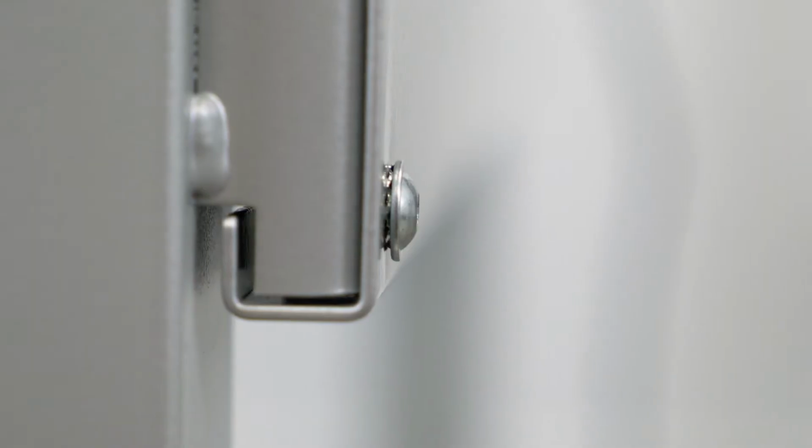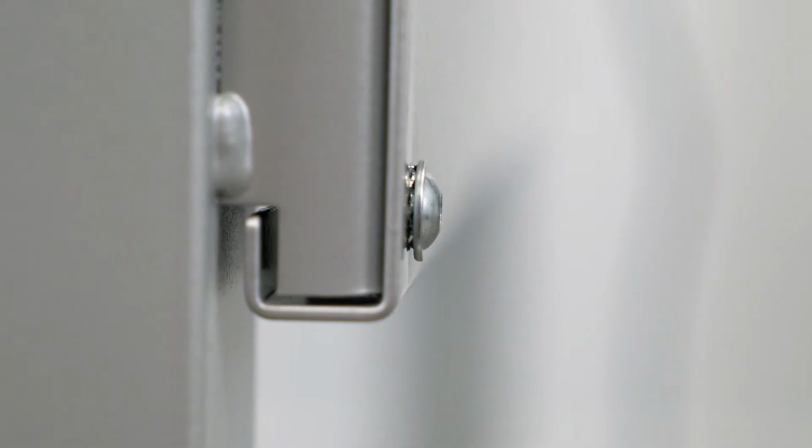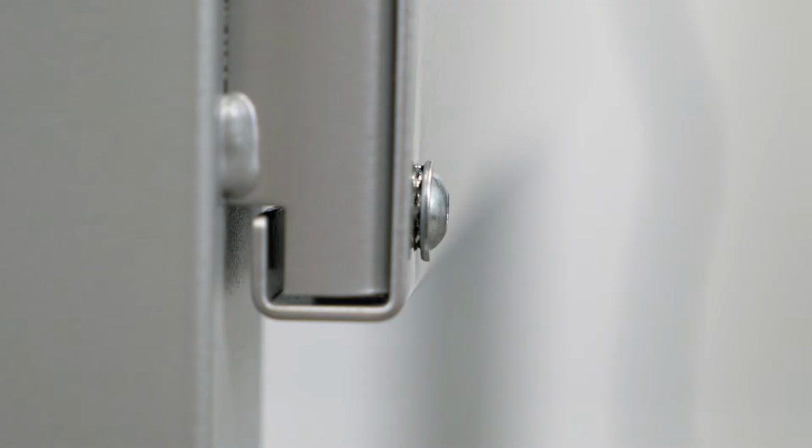Here you can see that the washer's teeth are angled both toward the head of the bolt and the surface of the other adjacent material, such as a metal desk leg or a metal bracket. Without a star lock washer, it's much easier for the bolt to loosen and shift over time as you use your desk. So all that's holding the fastener in place are the bolt's threads, and as the bolt begins to loosen, the desk assembly will weaken. Then you will start to experience desk wobble and instability.